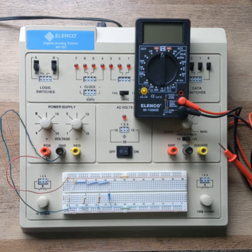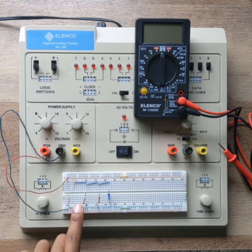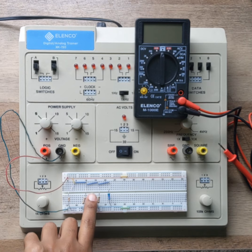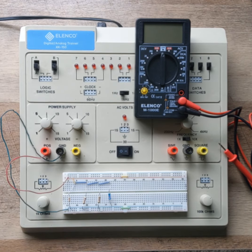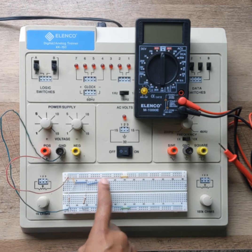The way I have this set up is I first have my resistors here. This is the 3.3K, 2.7K, 4.7K, and the 5.6K. Notice that they are in parallel here — they are connected across the top and connected to ground here.